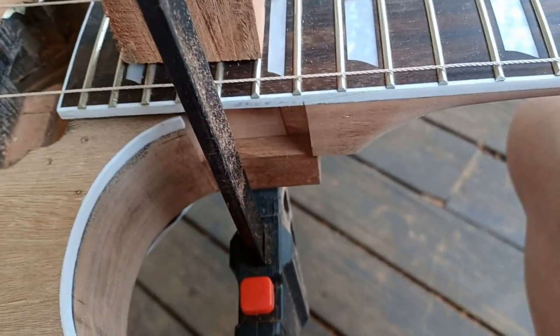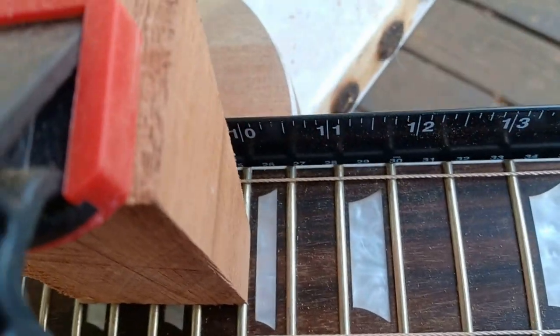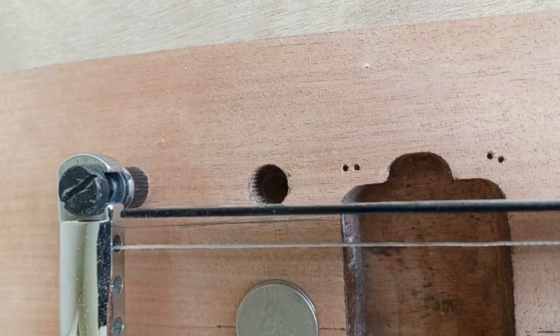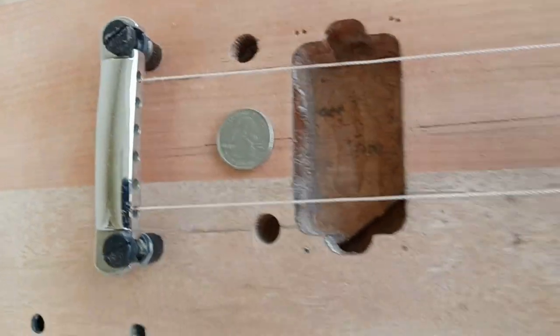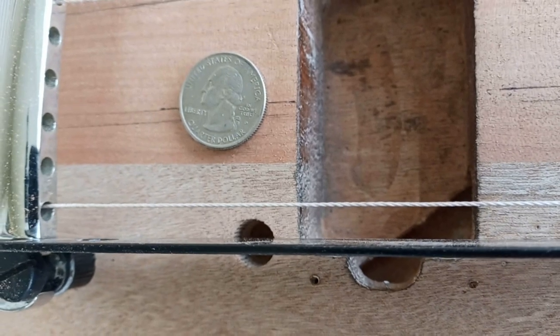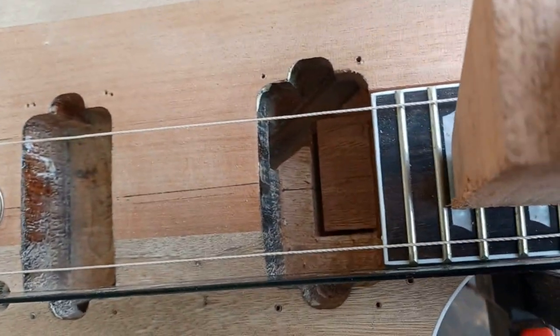Since I have to play around to fill in this deck here, it's now loose, but that's going to get filled in. That's the next piece of the puzzle. Let's look at where the neck is — that's where the neck joint was when it was loose in there and lined up with the center line. Same thing on this side. So we are about as centered as I can get it by hand, without CNC or routers. We are now straight.